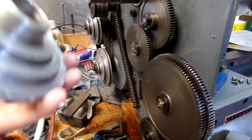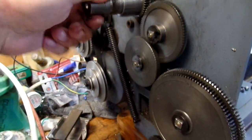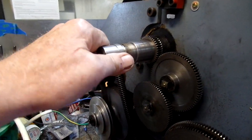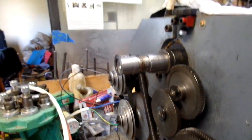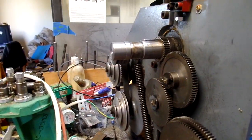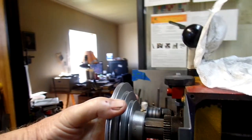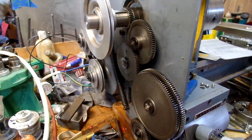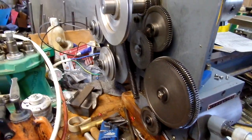I had to use a puller to move this thing off. I also had to make an insert, and I made it a little tight, so I've got to pop that out with a bar through the spindle. But this should be pretty straightforward. Always check a scratch pass with your thread gauge. Good luck.